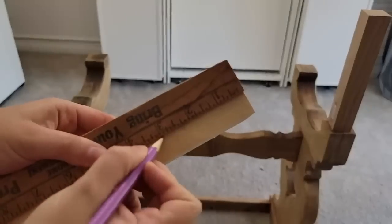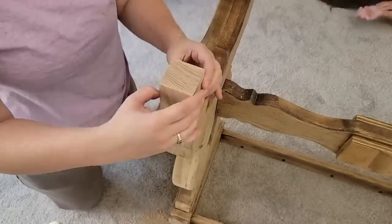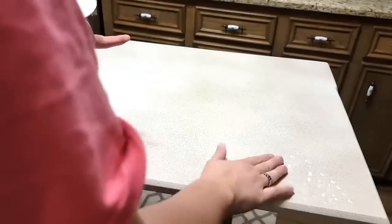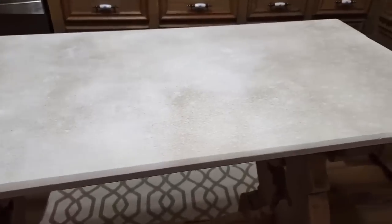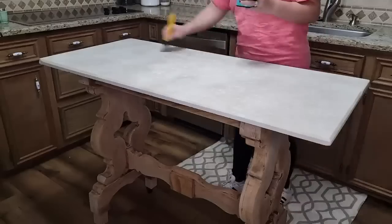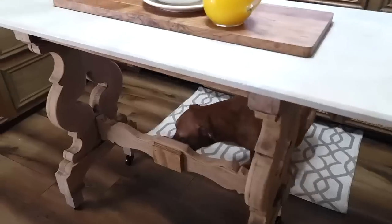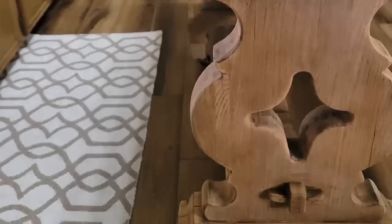In order to raise this island I created some feet out of block wood from Lowe's, cutting it to the size I needed to get to island height, then applying it using wooden dowels and lots of wood glue. When I put the top on it looked a little too plain, so I dabbed on some paint to create more white flecks, inspired by my own granite countertops. Then I sealed it all with a matte poly acrylic. This piece I sold and then used the proceeds to give a giant tip to a waitress who served us breakfast — I love doing those surprise big tips.